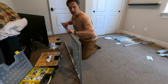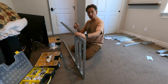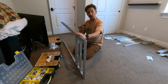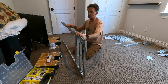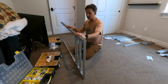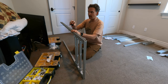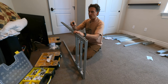I'm pushing the assembly all the way down to the end to bottom it out, keeping it as close to the front as possible, while also pulling the track in the other direction. This is an advantage of using a 10-32 in a one-inch profile — I could also use a quarter-20 bolt. Because there are 24 fasteners, there's hardly any tension force at all, just a little shear. By pulling the track all the way down, I can make this track basically flush with the top, since the track is about a tenth of an inch taller than a one-inch extrusion.